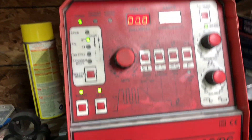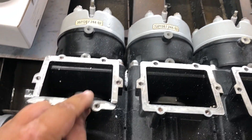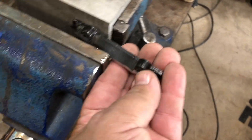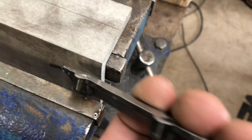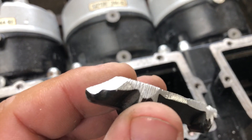When we started, the part was already broken off during shipping. Looking at it, it was all twisted and tweaked really bad. So we put it in here — you can see the heat marks right here in the middle from the propane torch. Twisted it straight with a little crescent wrench and now it's nice and straight. Ground the edges on the backside so we can get a good weld on there, and chamfered the inside.